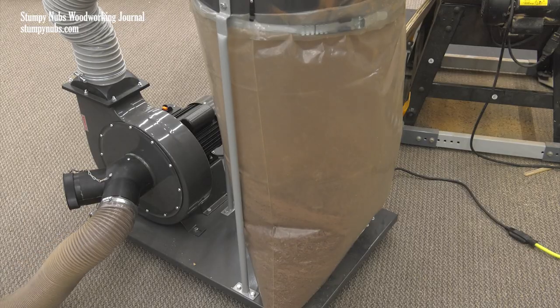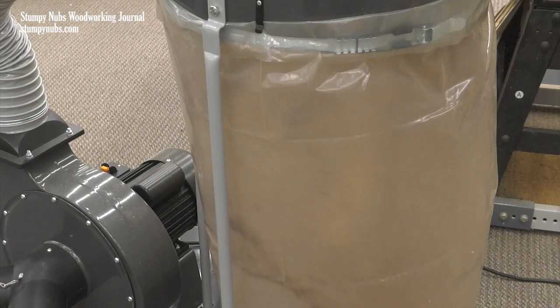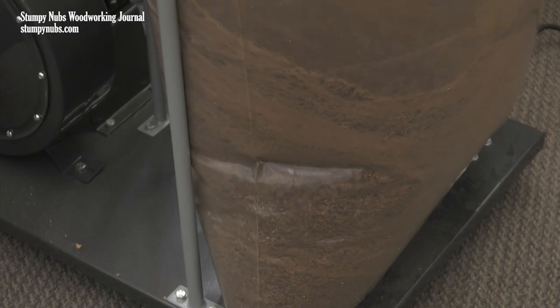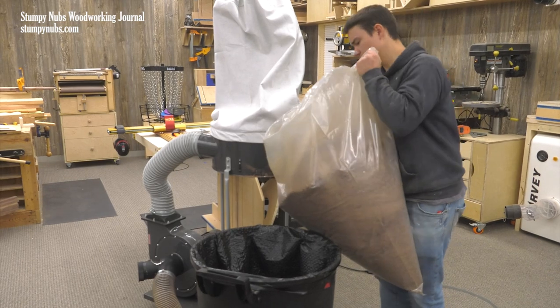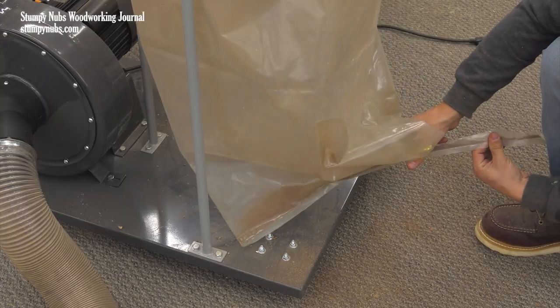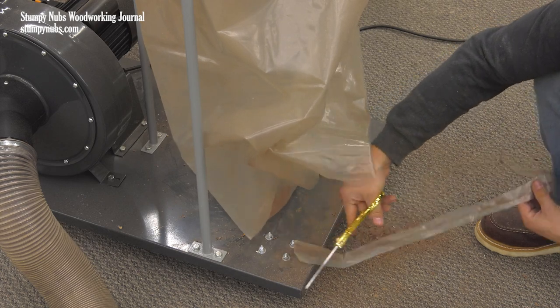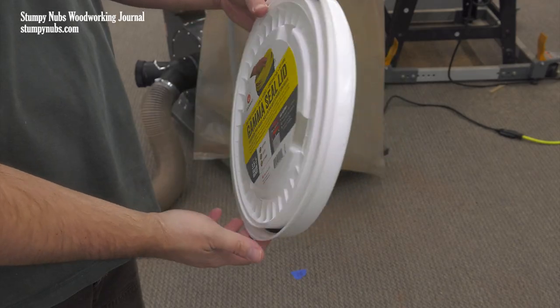But first, I want to talk about a modification I made to the collector bag below the filter. Unfortunately, these bags aren't really disposable, because they have to be really heavy-duty to hold up to being blasted by a stream of sawdust, and they have to be transparent so you can see when they're full. So most folks empty and reuse the stock bag many times, and that is an awful dusty chore. The alternative is to just cut the bottom off the bag so the chips can fall out without having to remove it. Of course, you don't want your chips all over the floor.